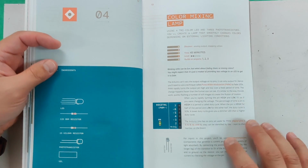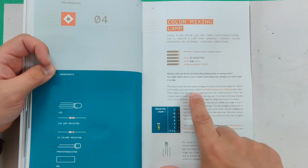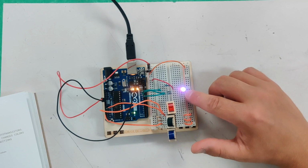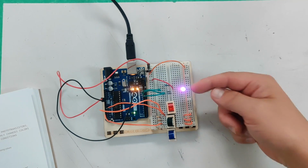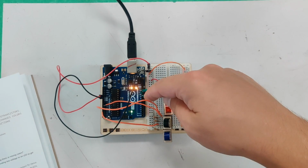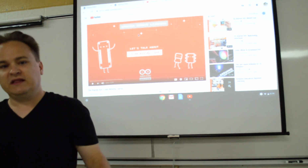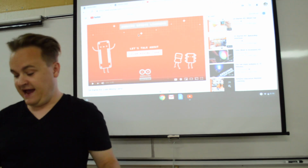First of all, you're going to be doing something called PWM, pulse width modulation. You can read about this. See, you can't vary the output. The Arduino only sends 5 volts out of your digital outputs. And see, each one of these pins on this light that we use is getting voltage from pin 9, pin 10, and pin 11. And then there's obviously a ground pin there in the middle. So you're getting feeds of voltage from 9, 10, 11, all going to this light, but they can't send lower voltage or higher voltage. Like they can't send 4.5 volts or 3 volts. They either send 0, low, or 5 volts, high, right? So they're sending that light.